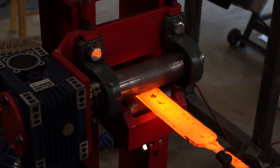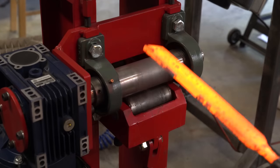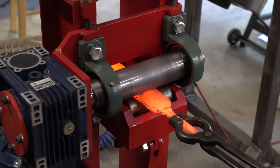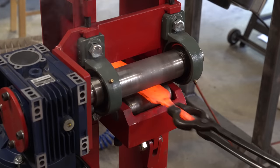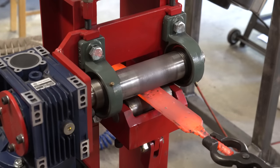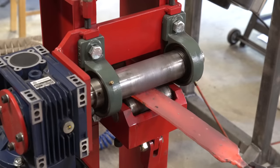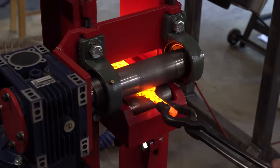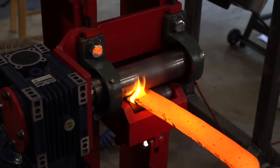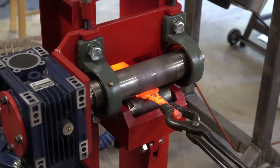A rolling mill is a luxury and most people won't have one, but it has a lot of benefits. The first is that it only draws in one direction so you're not widening the billet at all. You do have to be careful with that though, because your circles might become ovals if you use the mill too much since it draws only in one direction. The other benefit is that there's very little heat loss — the rollers come in contact with the steel very little so it doesn't pull a lot of heat away like a press does.